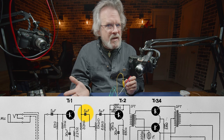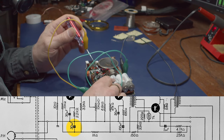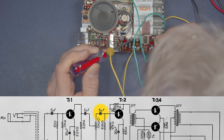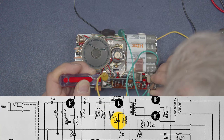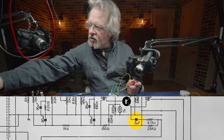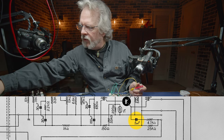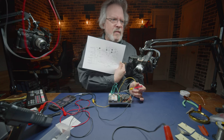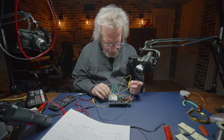The other two stages are obviously working. That's really faint - that's a little bit better - I'm working my way through the circuit. That's further through the circuit. That's the last capacitor for the push-pull amplifier, and I know that because I have a schematic - I've actually gone through the circuit. But I'm still not getting anything at the input.